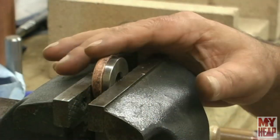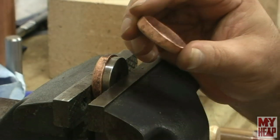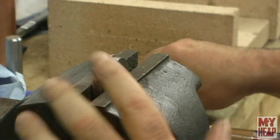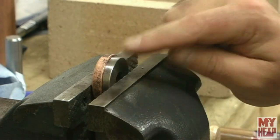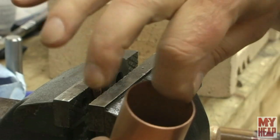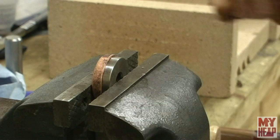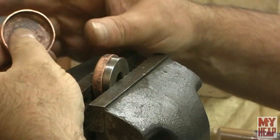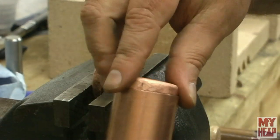I'm on the second end cap — I nailed the first one. I finished the first one and I'm mostly around with the second one. Now the thing I want to mention is that the outside diameter of my form is based on the tube's inner diameter minus twice the thickness of the wall — that's how I derived the OD for my form. But as this copper folds over, it's going from a large area to a smaller area and the metal has to contract.